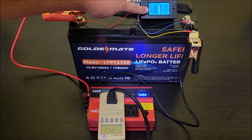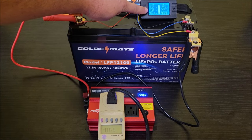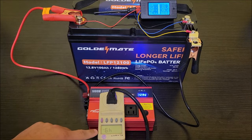Looking at the battery monitor side, it's showing about 450 watts being drawn from the battery, while the Kill-A-Watt on the AC side reads about 396 watts. That difference reflects the inverter's conversion losses — there's some power lost in the conversion process, which is normal. The inverter is running the dehumidifier with no problem.